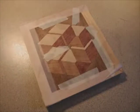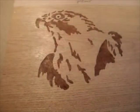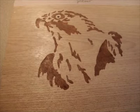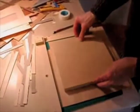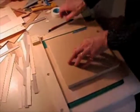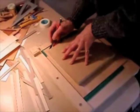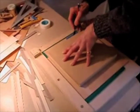Here is a work in progress that will give you an idea of what the finished pattern will look like. Here is the piece of work that Barbara has selected for vacuum pressing. In order to prepare it for pressing, it needs to be cut down to size. Barbara first lays her veneer down onto the cutting table, then takes her substrate material — in this case half-inch MDF — and lays it on top of the veneer.